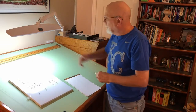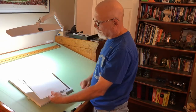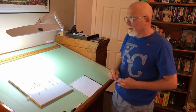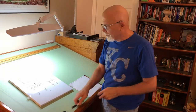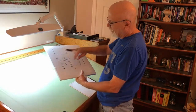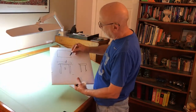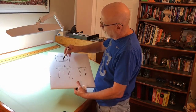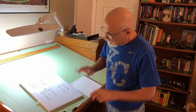You can do that on the drafting table, or you can make just this front view on one piece of paper, take another piece and do the side view. From this you have to figure out the sizes of all the pieces you're going to make. In this case with our table, we'd have to figure out what our four legs look like — how tall they are and how thick — and the same with the top, whether it's going to be one piece of plywood or a frame and panel. So you have to know all of that and make your bill of material.